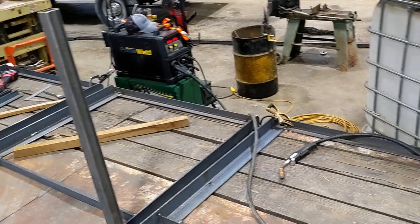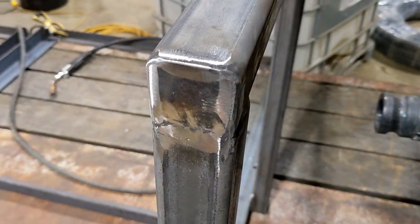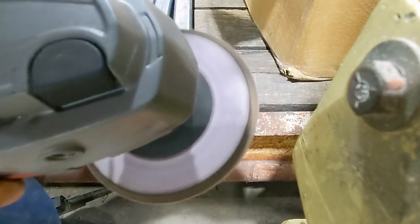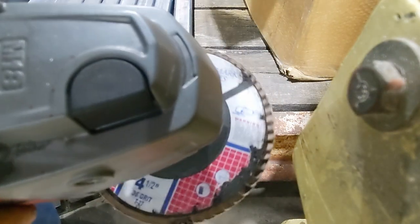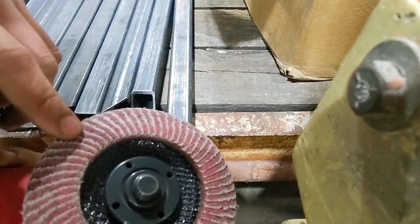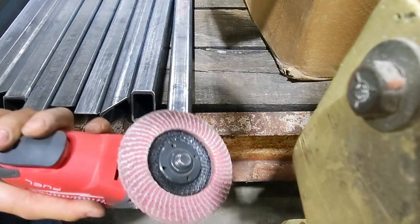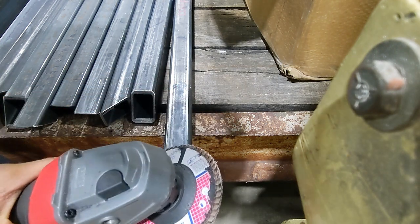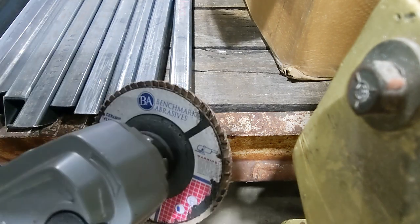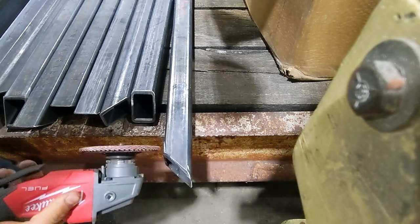If you want an easy way to make your project look more professional, just put caps on the ends of your tubes. Just do a better job at welding and grinding than I do. Get yourself some 36 grit flap discs, ceramic flap discs. So much nicer and quicker, smoother, just better than a hog wheel. Quieter, just really nice. I got mine from Benchmark Abrasives. Not sponsored, I don't care where you get them. But if you're doing this type of thing, go get them.